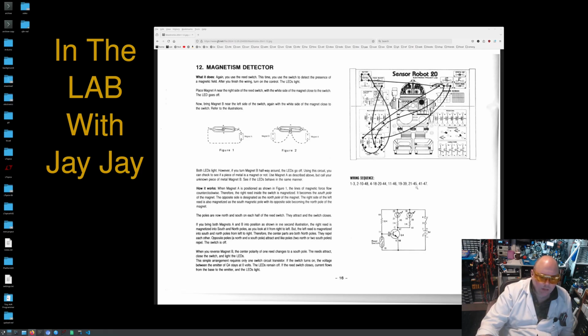It's only one line of, not even a full line of things. So we've got two LEDs joined with 1K resistors, and there's a 10K resistor over here as well. And we've got a switch for on and off for the circuit, and the 9-volt battery, and one of our NPN bipolar junction transistors.